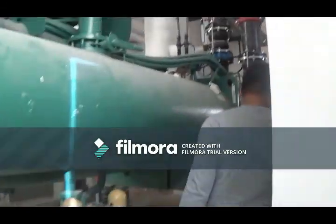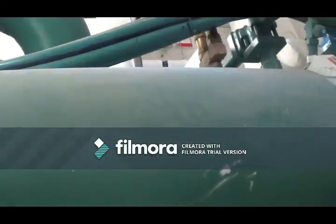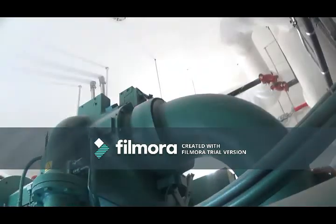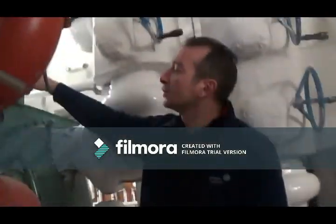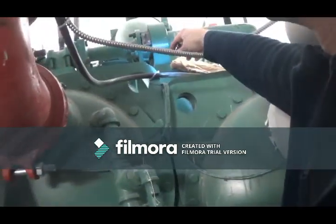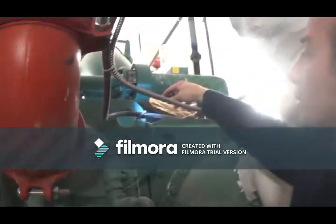There is an oil level on the machine, and that's on this sight glass right in the middle there. It's going to be hard to see, and that level there will be red right now with the red line. If there was oil, it would make it thicker. So you have to find the right zone to see it. Do you see that right there? See how the red line is thin? Because there's no oil in it. When there's oil in it, the red will be thicker. So we want to be somewhere in the green when we're running.